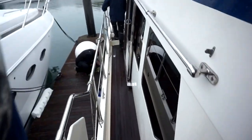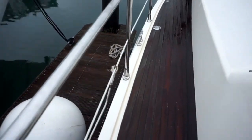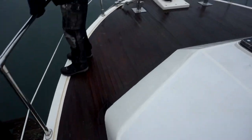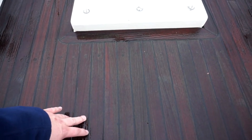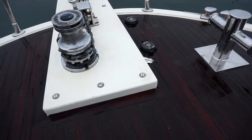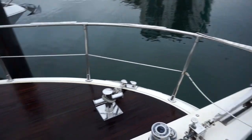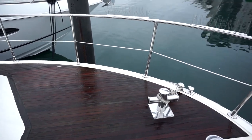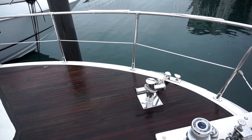Brings it nicely up. But before we do that, and because it is still wet at the moment, we've got to sand the decks. Not much, but just enough from just the forward area here, because the caulking is just a tiny bit proud. So the stern sun deck area has been done previously, this hasn't, so we're just going to give it a light sanding. Sorry about the wind. We're using an 80 grit paper, and then we'll put the renovator on, rinse off, and it should look all lovely and honey and protected, the colour of the wood.